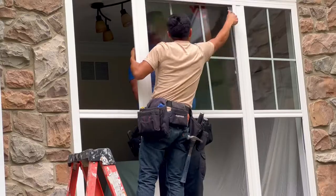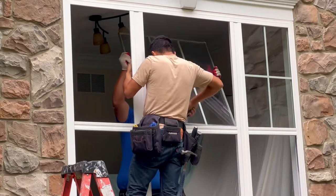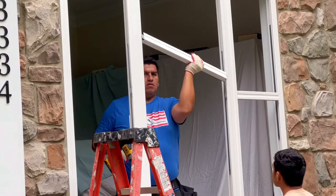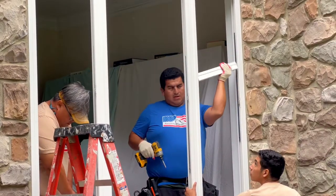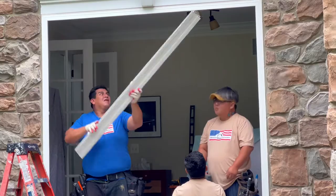In this video we're going to run down the process of installing a beautiful new bay window. First we'll break all the seals and remove all existing panes, followed by cutting out the current frame and window mullions. Then we'll remove all the interior trim carefully, as some of it can be reused, and we're left with a giant opening.